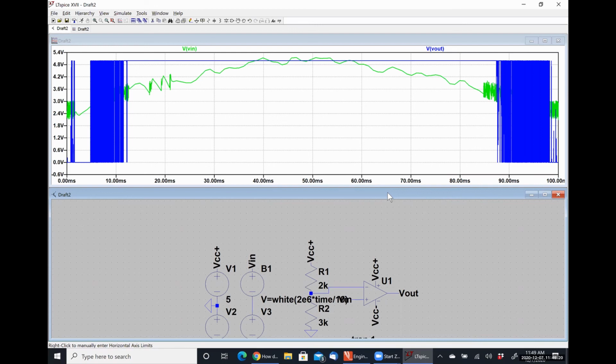So what we're going to talk about in the next class meeting is positive feedback circuits, where we're going to introduce effectively a little bit of memory into our inverter circuits in order to make them latch to a particular value, so that if there are small variations, it'll still stay high. If it's small variations above what we call the upper trigger limit, it'll stay high, and if it's small variations around the lower trigger limit, it'll stay low.